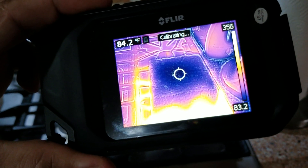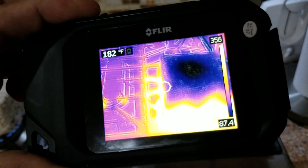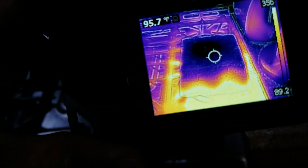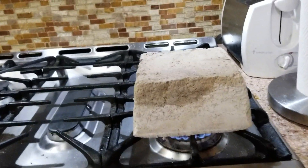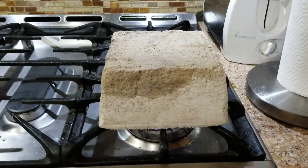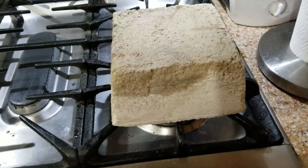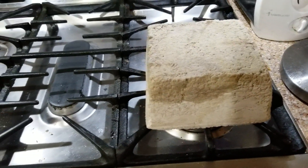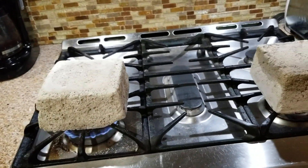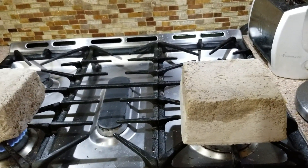The 30-gallon mix top is reading 85 degrees, and if I move over a little — bam — 356, then 351 on the side. That's really good insulation, and this is only about 4 inches thick. The plan I have for my dome is to have about 9 inches of insulation, so you can imagine what that would be like. It would be a great structure to have where there are fires or potential fires — I think you could feel quite safe in a dome structure with about 9 inches of aircrete insulation.